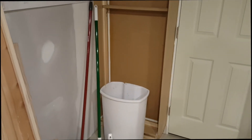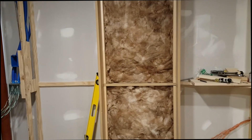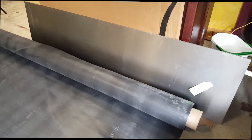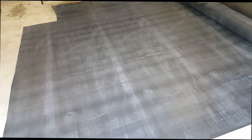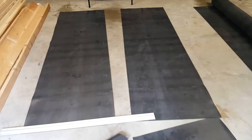Then insulation and more fabric over top for the facade. The next step is to build the membrane itself, which is two pieces of rubber sandwiching a piece of sheet metal of varying sizes depending on what resonance you want or which frequency you want to trap. Here we have our EPDM rubber which we're going to use to create the membrane for our traps. Here's the sheet metal in various thicknesses, all cut to the same size to fit into the enclosures. I'm going to cut out sheets of this which will then have the stainless steel sandwiched between.